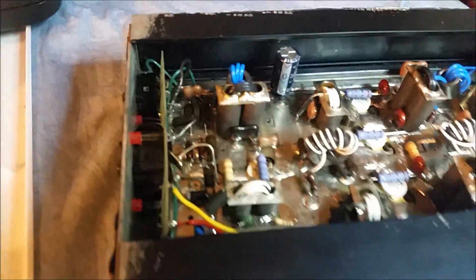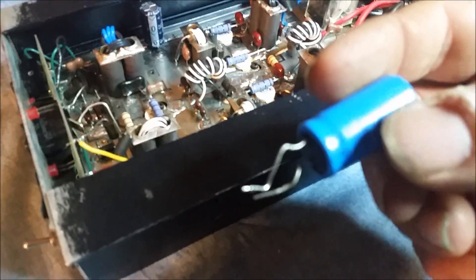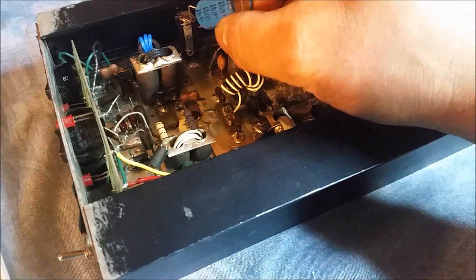They break the input up into two tuning sections on these amps using these trimmers right here to do that. I usually like to mic them all in because if you get in there with a screwdriver and you're off, you're messed up unless you know what you're doing with tuning. I went ahead and retuned that for you, bud. You had to use two silver dip micas to get that exact value and went ahead and mic'd it in right here as well. Now, with the filter caps — these did not come factory, somebody added them.